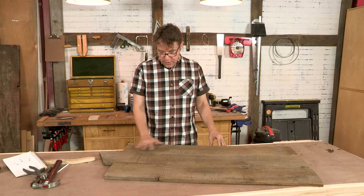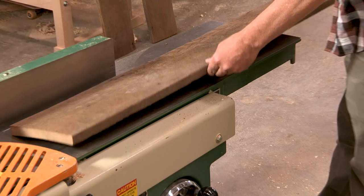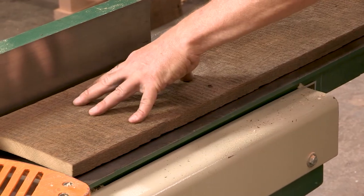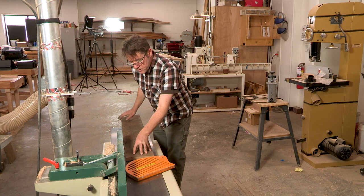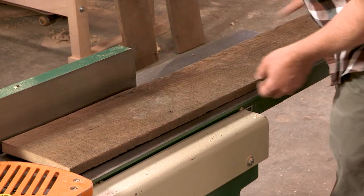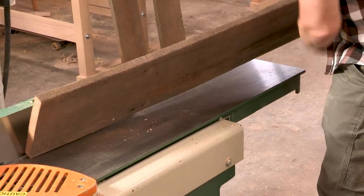The next step is to join the underside of the boards, removing as little material as possible to make it as flat as possible. Some of them have a moderate twist, some are more flat. In this case, this one has a belly underneath, so what I want to do is not push too much on the front of the board — otherwise I'll get a trapezoid board. I'm trying to find a balance point between front and back and ride on the bed of the joiner so the belly in the middle will be milled gradually until it reaches the front and the back.